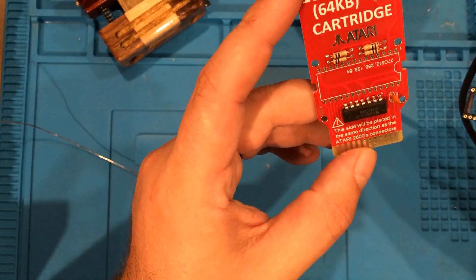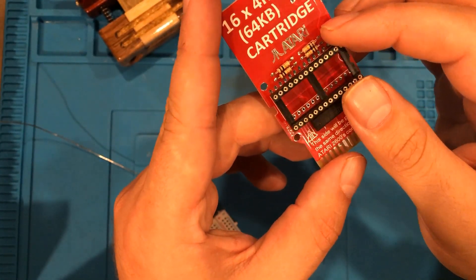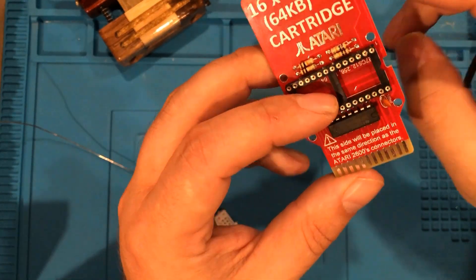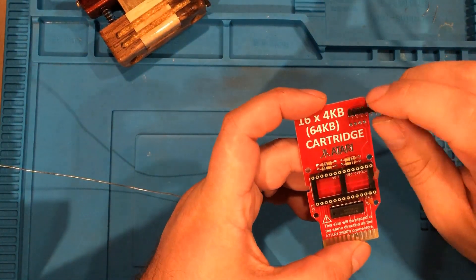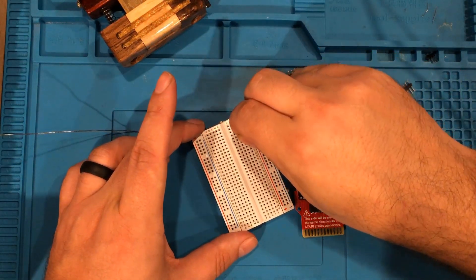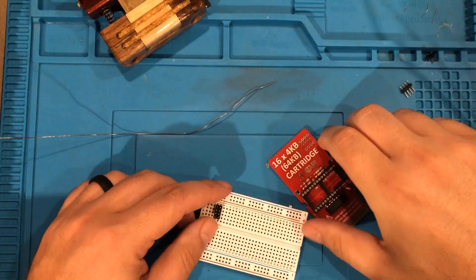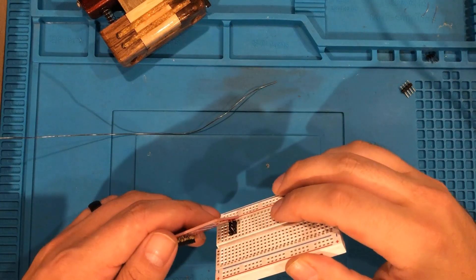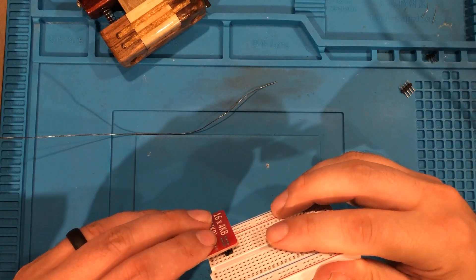Now I am going to socket the ROM. I do regret buying this style — I was told these were kind of the better ones, and they probably are in terms of connection, but they're a bit of a pain to get the socket inside that perfectly round hole. There's just nothing really guiding it in; you kind of have to get every single pin perfect. I'm going to go ahead and socket this and we'll move forward. Now as I mentioned, I'm going to do one of these with dip switches, so I'm going to go ahead and cut off four and four for my header pins. The header pins are cheap, so it's really not worth going out and buying dip switches — we're not going to change games that often. So we're going to solder two rows of four pins and there you have it.